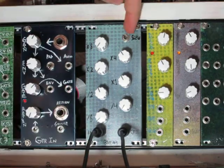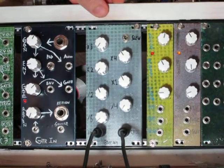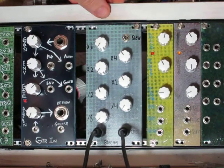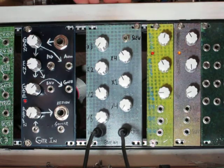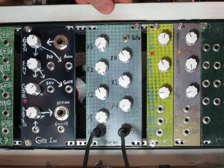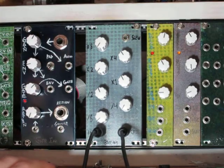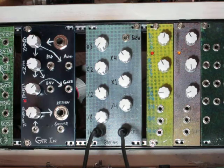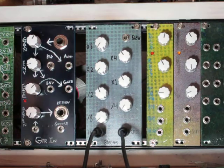Right now when it's all the way to the left, it's a 1UF capacitor, which reacts relatively quickly to note changes and tunes relatively well at lower frequencies. Now I'm going to put it over to the 10UF. As you can hear, it sounds a little bit... there's a little less scatter with the notes. The sequence we have right now, the notes aren't quite far apart enough that you hear much change between notes or slew, but if you were having really big changes in frequency, you'd hear that.